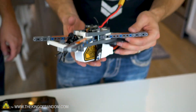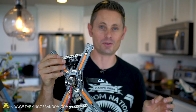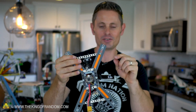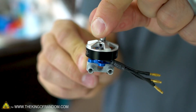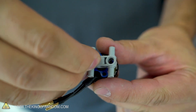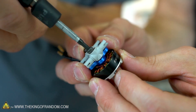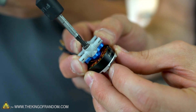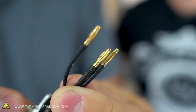The little pieces at the ends of the arms are these little H-shaped pin connectors with two holes in them, which are absolutely perfect for attaching the motors. What I love about this design is you could have multiple motors — if one fails, you can just click it out, click the new one into place, plug the wires back in and you're good to go within seconds. Most motors use standard connectors which happen to be the exact same dimension as this LEGO Technic part — exactly 16 millimeters. So the motor just connects right here onto these motor mounts, and then we put two screws right through. Now all we have to do is make three more of these, swap them out, and we're just about finished.